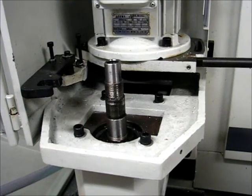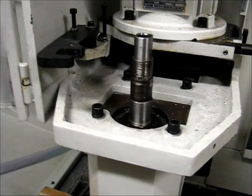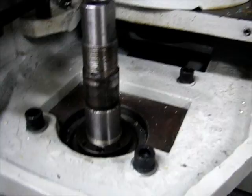So what started off as a belt test has become something a little bit more substantial than that. When I loosened up the belt a little bit to do some testing and see if that would cut down on the belt noise when I put the Fenner linked belt on there, I suddenly had a chattering coming from what sounded like the bearing on the top here, so I figured I'd tear into it and see what's going on.